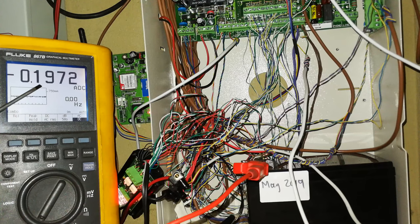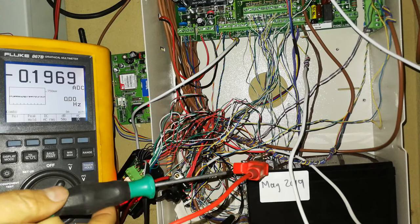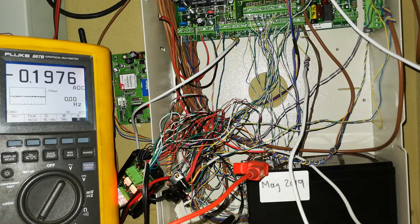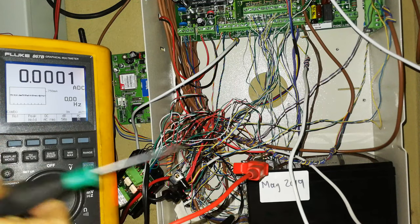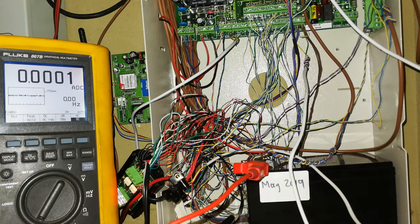That battery is not heavily loaded at all because I've already removed 0.6 amps - the sensors and keypads were taking 400 milliamps and 200 milliamps, so I've released 600 milliamps. In other installations I've got setups where each battery bank is being used at one amp, which is why I had to spread the load - it's the same way you wire a DB board, balancing each phase. Look at that - the alarm actually died! That battery needs to be charged. Even 0.2 amps can deplete a faulty or partially discharged battery.